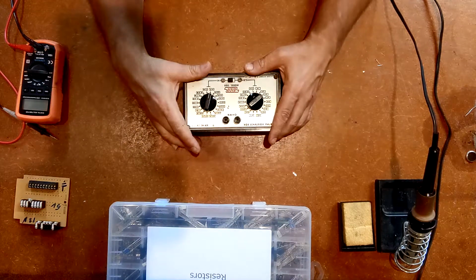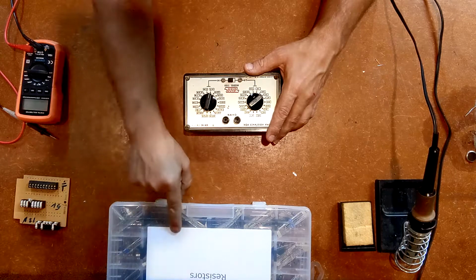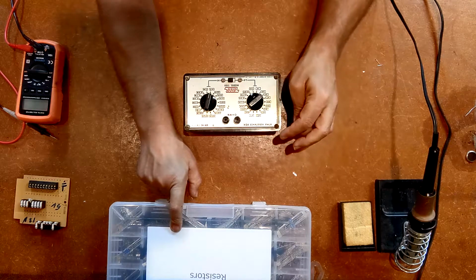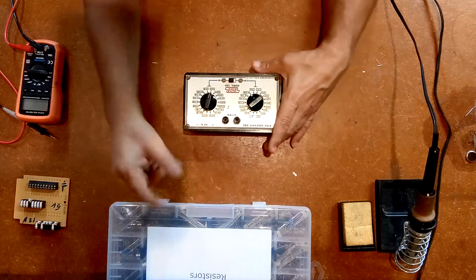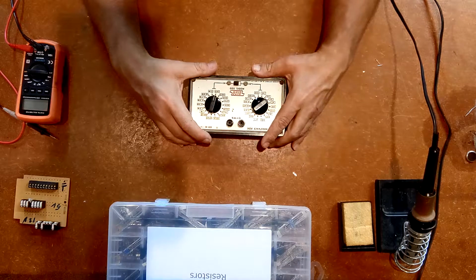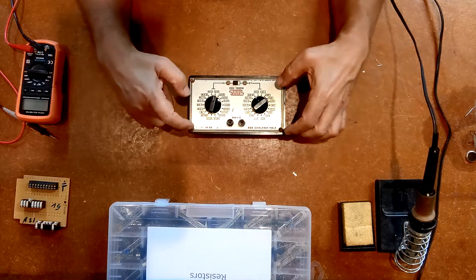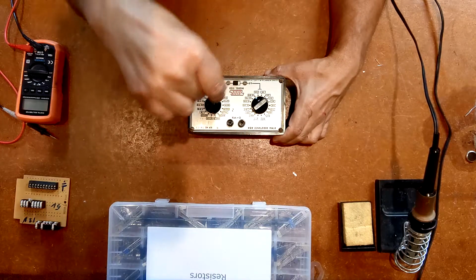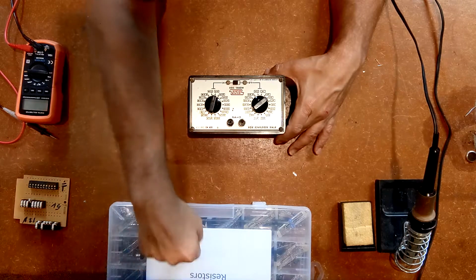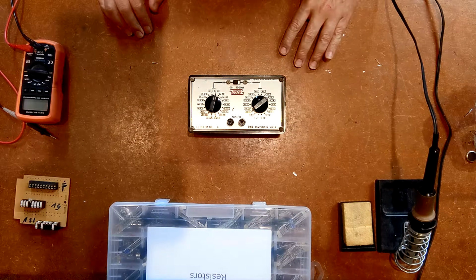The only downside to that I can see is you can get a very specific resistance on a decade box, but then if you try to find an actual resistor, unless you're dealing with military specifications, which can get extremely accurate, if you're just dealing with common resistors, a substitution box really is the key. And for most calculations, if your resistor is off by a little, it's not a huge deal. So, ultimately the project today is I'm going to take the screws out, pull the top off this box, find the dead resistor and replace it with one of these. I'm hoping that I have something of a high enough value. So let's get to that and enjoy the time lapse.